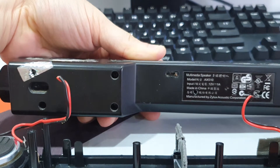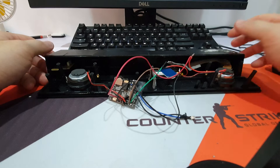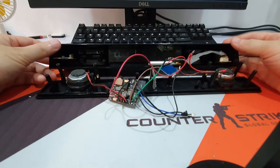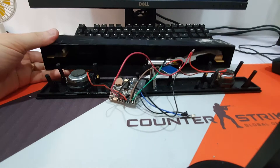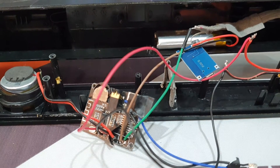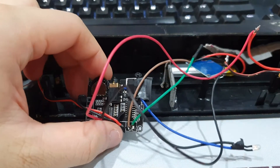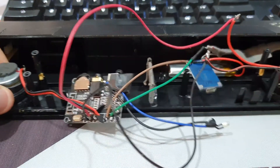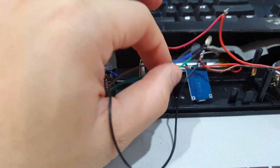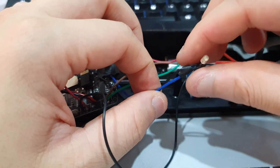Now I'm going to wire all the parts. So I've wired all the parts together — let me explain a little bit before I put everything in place. The battery is connected to the blue board, which is the charging protection circuit. The black board is the amplifier, drawing power from the blue board. The speakers connect to the black board. I've also soldered the original white LED from the soundbar to the amplifier, so it will light up simultaneously with the blue LED under control of the amplifier.